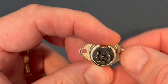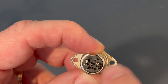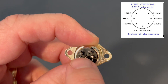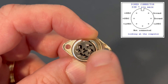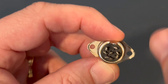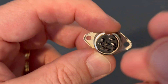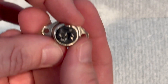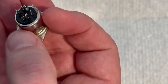So let's get to it. This is the connector — we need to define what goes where. These top two on the left-hand side, just rotating around: these top two here are plus 5 volts, followed by plus 12 volts. The bottom one is not connected. The middle one is not connected because that's not even available on the Atari ST. This next one on the bottom is minus 12 volts, and these last two up here are ground. So I'm going to connect these two together and those two together, so I only have to connect one wire to each, giving us four wires total coming out. First I'm just going to remove the two pins, then pinch those two closer together and solder them.